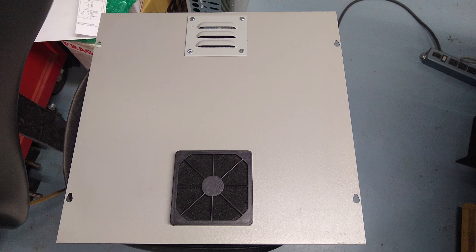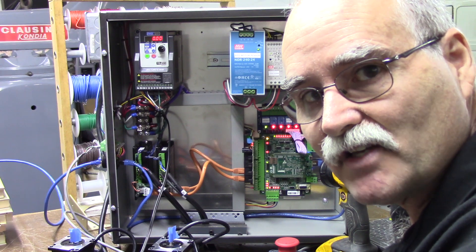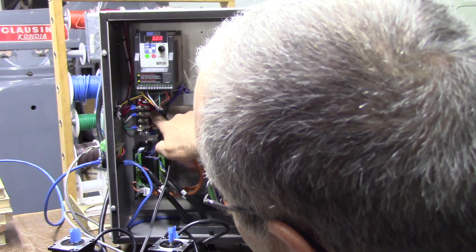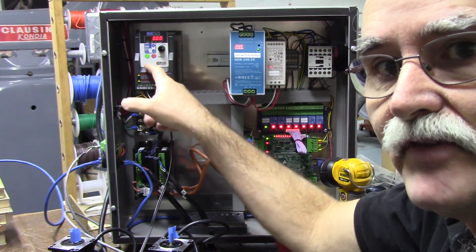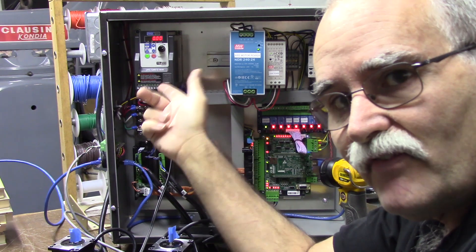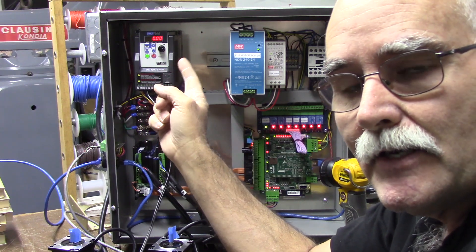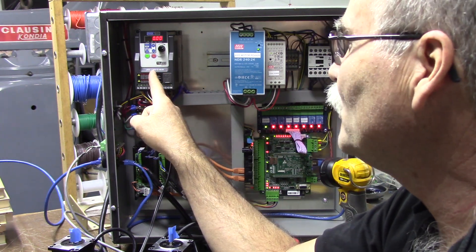The other leg here is for a cabinet fan on a cover that goes over this — the fan blows inward and exhausts through a vent out the top. This is a 110-volt cabinet protected by a 10-amp glass AGC fuse; you can get these anywhere. I tend to use fuses because they're fast-acting and easy to come by. One pair of wires goes up to the VFD — this is a 110-volt VFD, believe it or not, and it converts to 230-volt three-phase on the output. You can find 110-volt input VFDs on automationdirect.com; in this case I got it from factorymation.com — it's an FX Tough Drive TD-200.